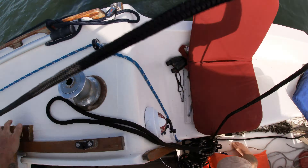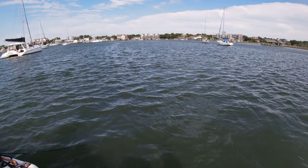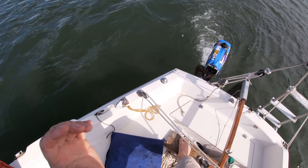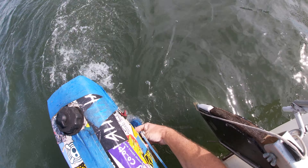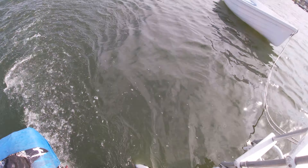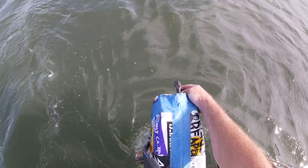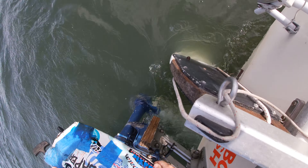You can see it's already routed to the bow. This is what's so effective about this procedure — you throw it over the side, it's almost instantaneously catching on something, and then you're paying out line and your motor is already going. Now I'm going to turn this motor around. I have a little wing nut down here that locks the motor, so I'm loosening it and turning it 180 degrees — that's my reverse. I can go anywhere in reverse like this; it's like a front-wheel-drive car.